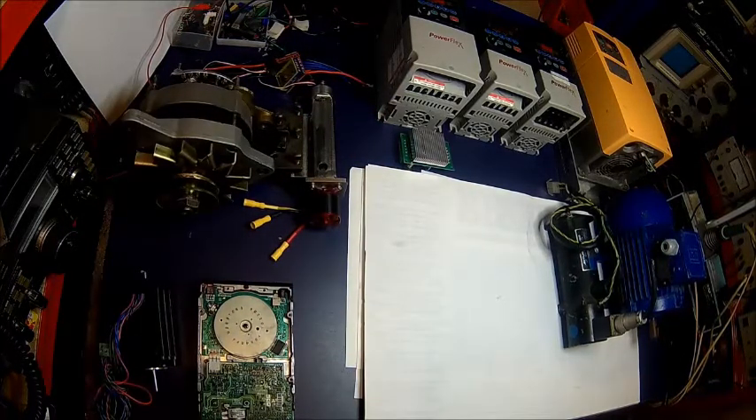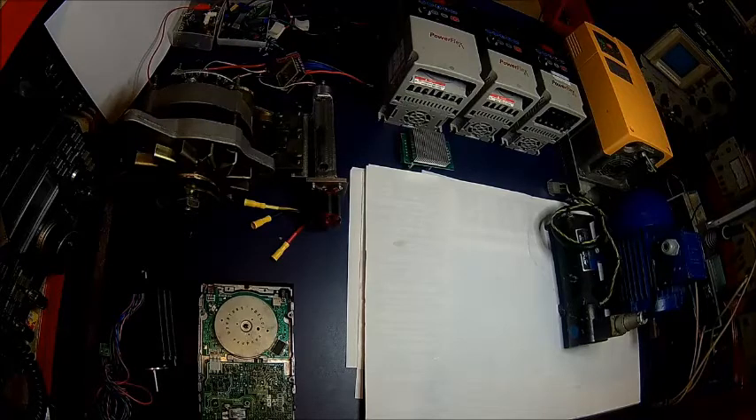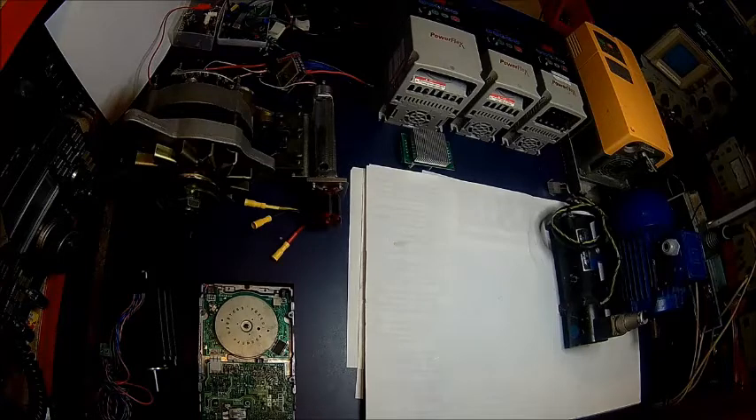We will probably also cover single-phase electric motors, particularly how to reverse them, because that seems to be a big knowledge gap. If you look on eBay you find many machines converted to single-phase where it says it doesn't reverse anymore. It's relatively simple to do if you know how, so we'll cover that in one episode — probably episode three or four. Essentially it's the same as on a three-phase motor: you just reverse the phases. If you do it wrong, you'll eventually fry your motor.